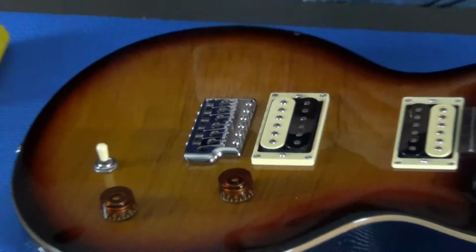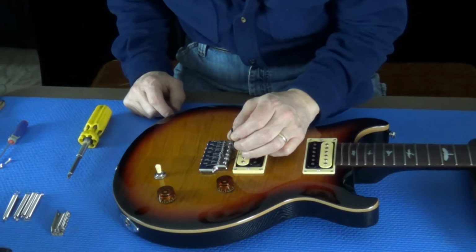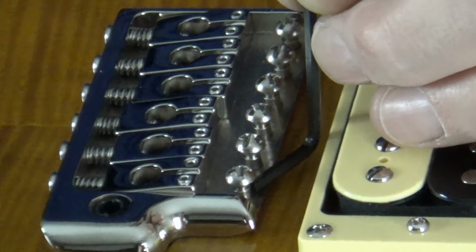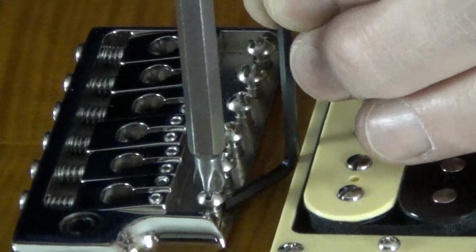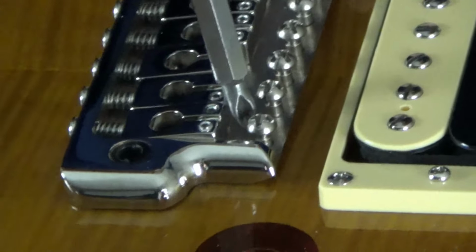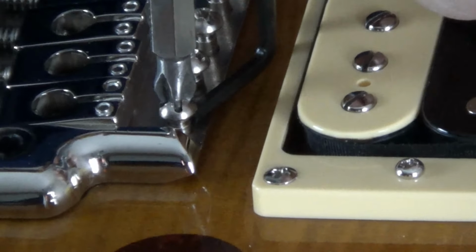Okay, this Allen wrench says right here, too small for you to see, but it's going to say on one of these flat surfaces, 2.5 millimeter. So what we're going to do is use the flat sides of that as a feeler gauge. You're going to crank down till the space, this is going to measure the space between the surface of the pocket and the underside of the wood screw. And it's just adjusting it till you feel it snug.